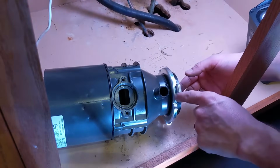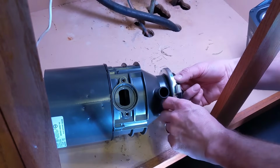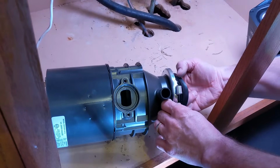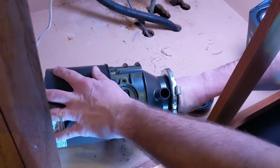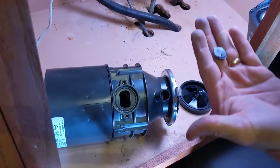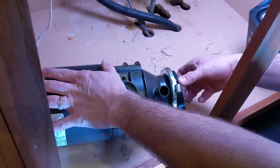And then once that cap falls inside the garbage disposal, you can remove this sink baffle by just getting a finger inside it and then gently pulling up, and that'll pop out, and then you can reach in there and find that cap to pull it out. And there we go. Put my sink baffle back on.